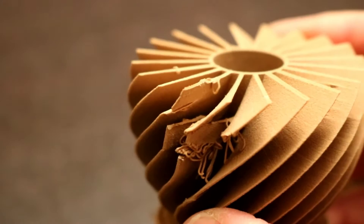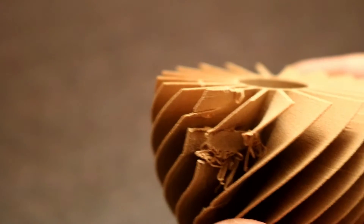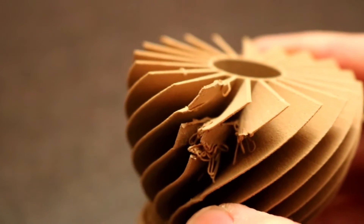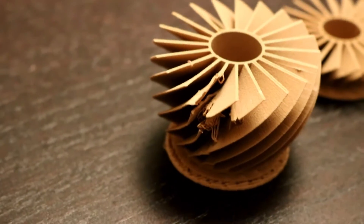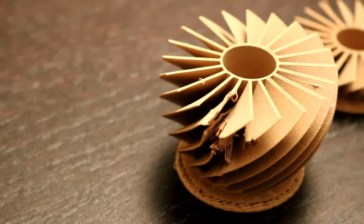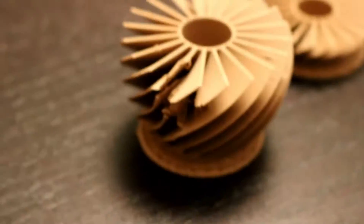This is what was happening to me: printing on the right extruder in PLA, my left extruder was hitting the print and causing this issue. It wasn't off by very much — when you're leveling the bed and you put a piece of paper or a business card under it, the left extruder just feels a little bit more snug than the right. That's all, and that was causing this.